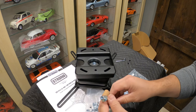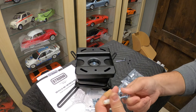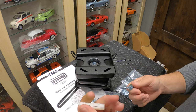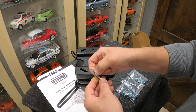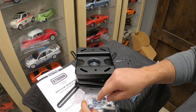These lags aren't really what I like to use — they're metric. I don't ever use anchors in concrete or drywall. We usually use Hiltis, or we're always going into wood on a projector. We won't do a projector into a drywall ceiling unless it's like 20 pounds or under. Then we'll use four Hiltis on this mount. It has to be lagged into some structure.